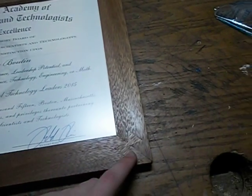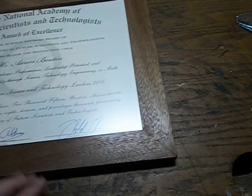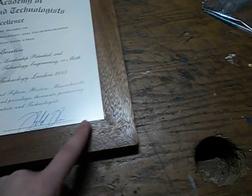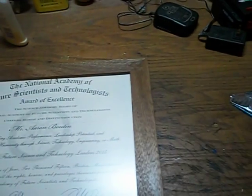But if you did want a stronger look, you could pull a half lap out here and put a dowel in the middle, or you could even put these out of the surface using a different type of wood. I was going for a pretty simple look so I didn't want all that contrast. I finished it with an antique walnut polyurethane stain finish, and then one coat of paste wax, and I think it looks quite good. It's actually ready to be hung on the wall.